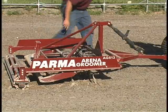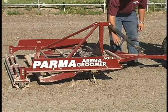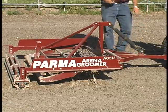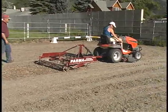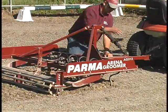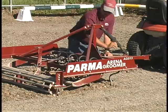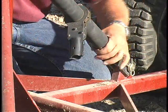Then, adjust the screwjack to raise or lower the tine level. Lengthening the screwjack will raise the S-tines out of the ground. Shortening it will lower the S-tines. Continue this process until the proper depth is achieved. Use the control nut to set the screwjack at the position you have settled on.